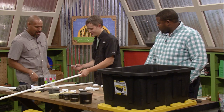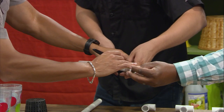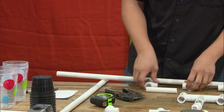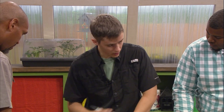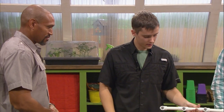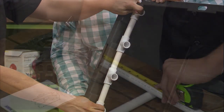We will get cutting. You want to do some cutting, Chris? Hey, I can try. Go ahead and grab this piece of PVC and we'll start measuring — four and a quarter inches. Make a mark right there, and we'll make six of these. Since we're not going to be using any PVC glue, we want to just push these together so everything's nice and snug. You do want a little bit of a snug fit just because things aren't glued together so it doesn't pop off.